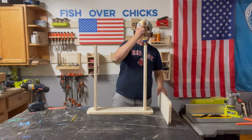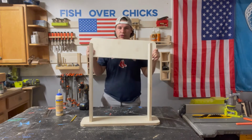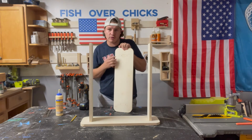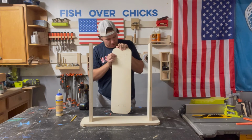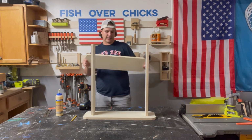Put the glue on these pieces. And then just go ahead and place this and screw on those. All right, so when you're screwing in these ones, I forgot to mention, you're gonna want the screws to go through the box. So once you screw your pre-drill through this little rectangle we made there, you're gonna wanna make sure that the screws are coming up through the rectangle so you can see the exposed screws through the rectangle, because then you'll be able to line up these rectangles to these pieces that you just glued. Just thought I'd mention that in case you make the same mistake I did.